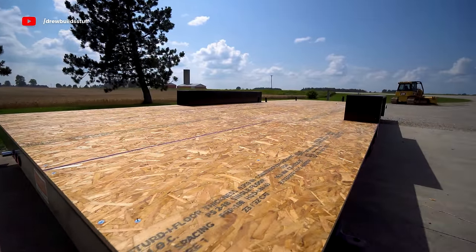Now with a few walls trimmed, I'm pretty much ready to start installing the siding panels. So the first thing I need to do with a fresh panel is just measure the width I need it at, and then rip this lengthwise. This is going to be my starter strip that begins the run of a wall.